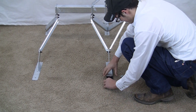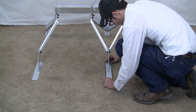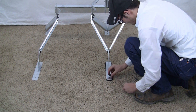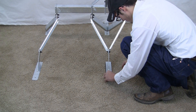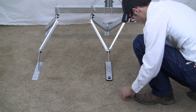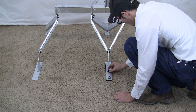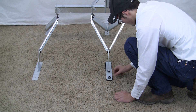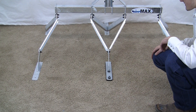When you get it up on the roof, this is how it's got to go. The rubber foot pads go down first. Then there are some rubber washers that go down, and then a steel washer sits over top of the rubber washer, and then you go ahead and use your lag screws. Make sure you hit a roof rafter with these.